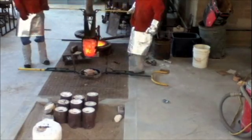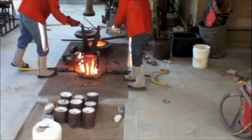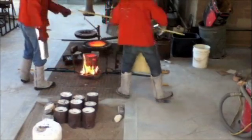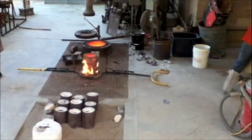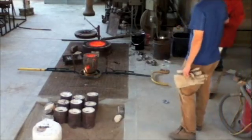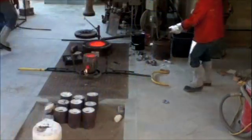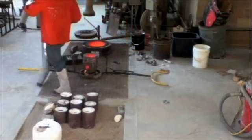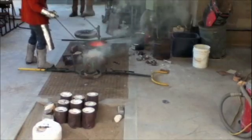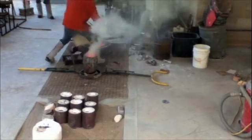The process is mostly the same, though instead of heating the metal to 2,000 degrees, we only go to 1,400. Once the aluminum is to temperature, we extract it and handle it in much the same way, except for one additional step. Todd hands me a pellet of hexachloroethane to submerge into the aluminum. This degasses and cleans the metal and makes it denser. With a prevailing breeze, I'm able to stay upwind and out of the noxious fumes. I have edited the smoke to run in reverse, for your viewing pleasure.